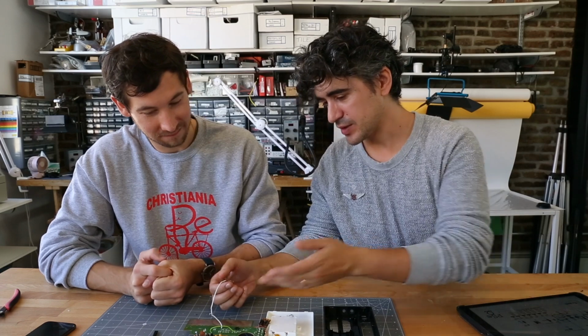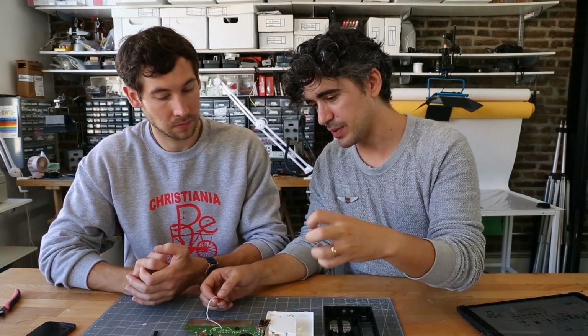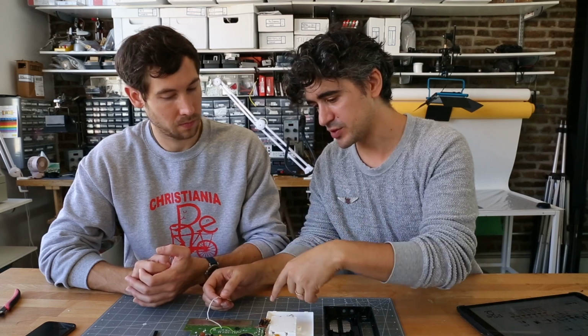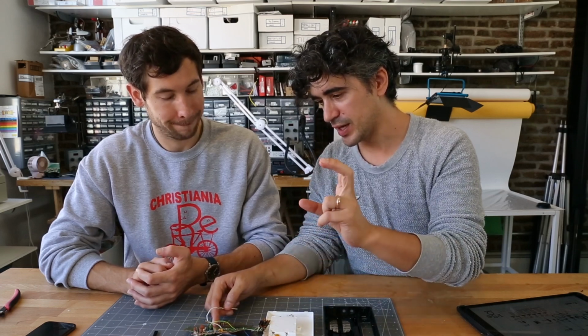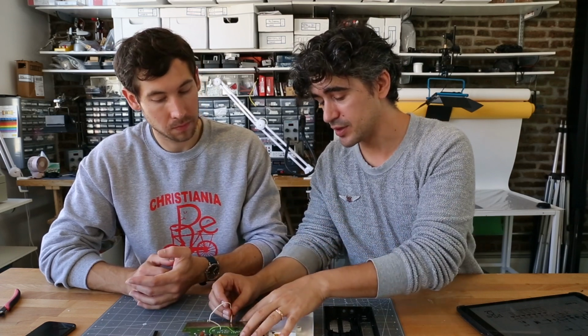The schematic we looked at looked like there was a square wave coming in. It goes through these resistors. When it recombines with the original square wave and the change in resistance, you get what they're calling a triangle wave in the schematic, and that's the tone you hear.